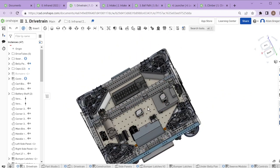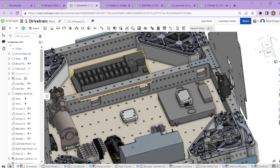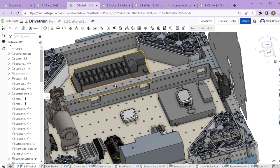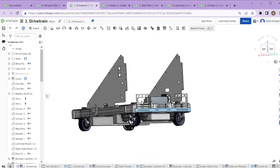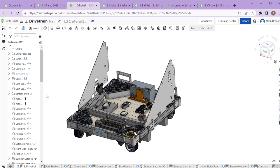We also have another rail used for supporting things above it, with cutouts for wire runs so we can have power and control wires run through without going over it. Nothing's too complicated in the drivetrain, and that's one of the reasons we moved to swerve — a much simpler drivetrain where we're not designing a lot of complicated sheet metal. Previous robots from 2020 and before took a lot more design work.